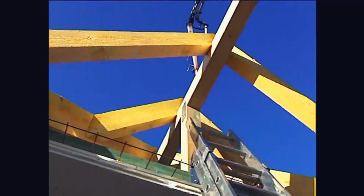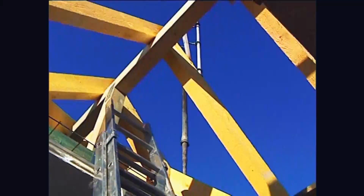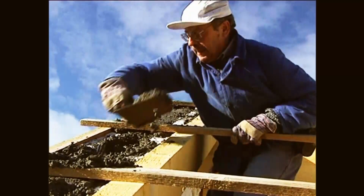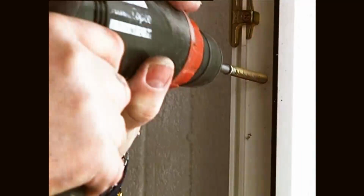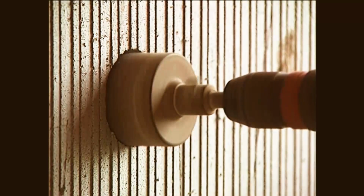After concreting the gable walls, the roof timbers are put up. After putting up the roof timbers, the pitches of the Argisol units are adjusted to the rafters and filled with concrete. Window units can be fastened in the concrete core without difficulty. Installing electric sockets and cables can be done by cutting out pieces from the polystyrene shell.